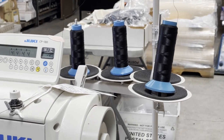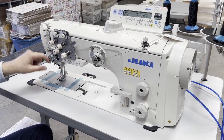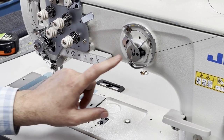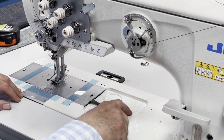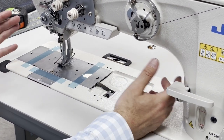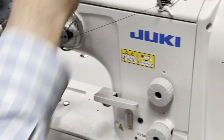You could go up to 270 thread. Here we have the foot tension right here. Here we have the middle foot higher and lower level. We have a bunch of memories here that you could use — the tension of the bobbin right here. The needle and all of these things are written with a safety clutch. Whenever you have a problem going over something really heavy that might break the needle and might stop the machine, this would prevent the machine from going out of timing. So it will lock itself, then you press this and play with this and it will come up again.